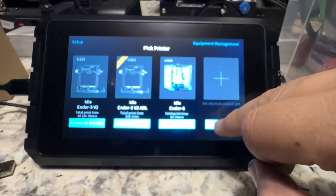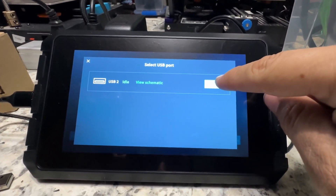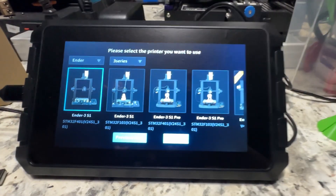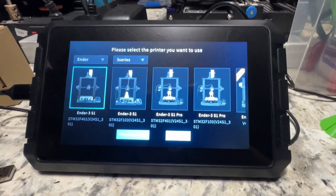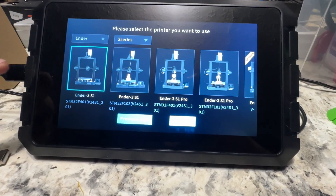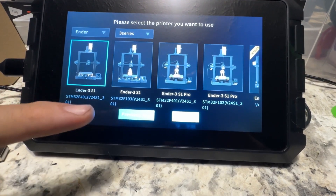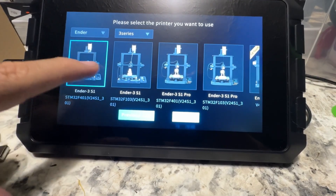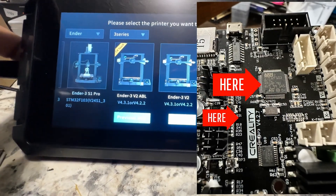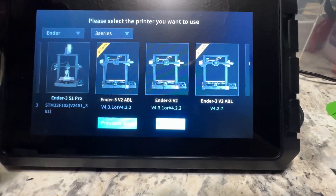Add a new device. We've only got one USB port left. Here's where I see people get hung up — you need to know what board is in your printer, specifically. You see here, these say STM32F401V. There are going to be different boards for different machines, or maybe you had to replace a board. Maybe you wanted your printer to be quieter, so you had an Ender 3v2 with a 4.2.2 and moved it to the 4.2.7.